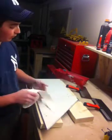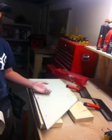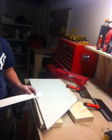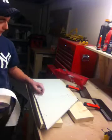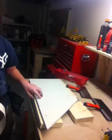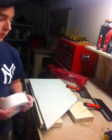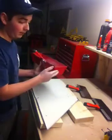They have mesh tape, which is different because the mesh is sticky at the back, and you just apply it right onto the drywall. And then you add your first coat over it. For the paper tape, you have to add a layer of mud, and then put the tape on top. That's how it works. So you also need the mud pan.